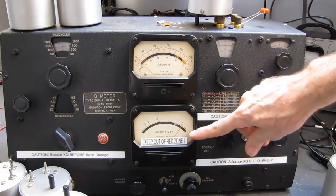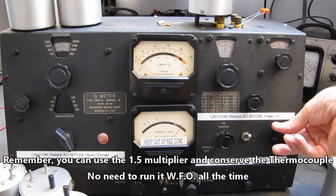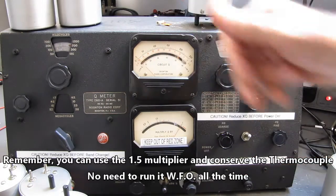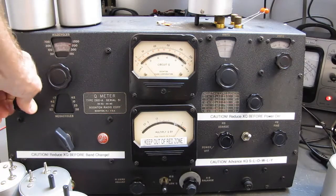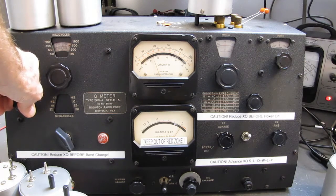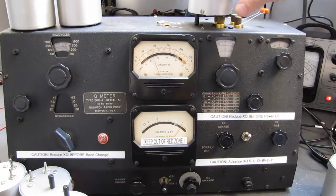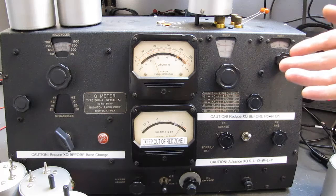We're on our number 1 calibration line. It's crept up a little bit as it warms up. There we go. Our meter is zeroed. I've got to find a resonance. There it is. All you do is go for the peak of resonance. And that's got a Q on this meter of 80. Now that's with this coil.